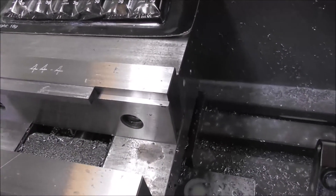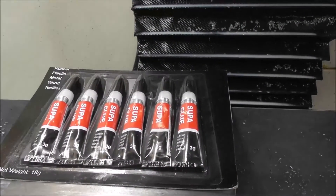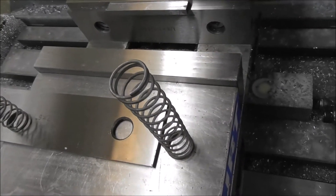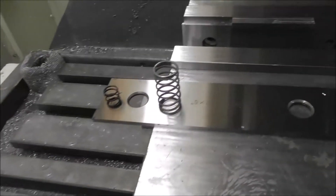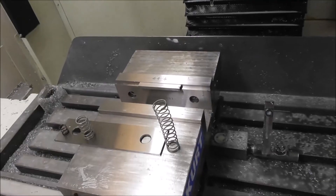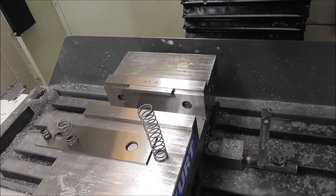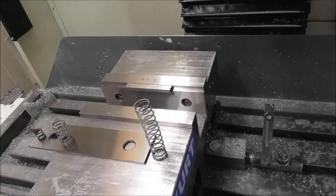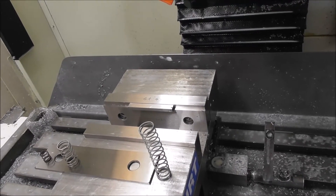One parallel may be held in place underneath your super-glued-on stop strip against the fixture of the vice; the other parallel may be held in place with a spring to keep the pressure there. It's worth collecting springs that are suitable for small, medium, and larger work to keep parallels in place under your work. You don't want your parallels shifting - they can get chips underneath them, and you may be drilling through the part and don't want to strike a hard parallel. Keeping them in position holds the part more securely and accurately.